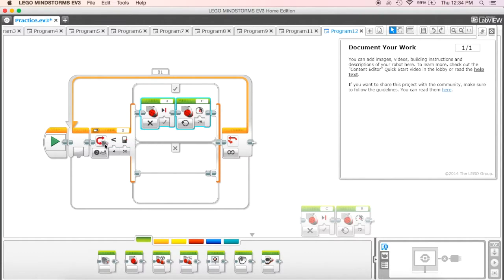I'm going to start this so that it runs on the inside of the circle. It's not really looking for the line necessarily as much as it's looking for the edge of the line — the edge between the dark line and the light circle. I'm going to use the line on the left-hand side of the darker line. My color sensor is looking for a value that is less than 50.